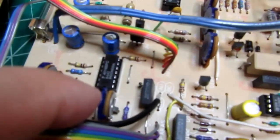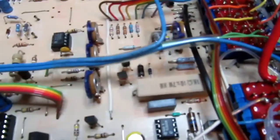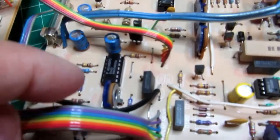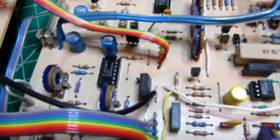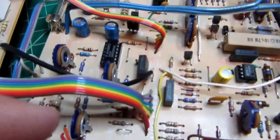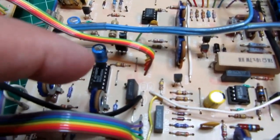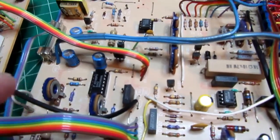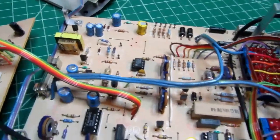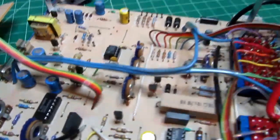Yeah, this is the 2 volt cal here. This affects all voltage and current measurements. And this is the 0.2 volt cal. And that again probably explains why this analog switches here. We're probably going to find that there are some resistor dividers that have these 3 pots in them, and that the analog switches in here are going to pick from one or another of those and feed that into the reference input of the IC. That's my story, and I'll stick to it unless study of the schematic tells me otherwise.